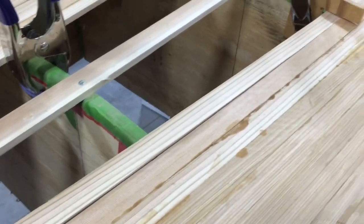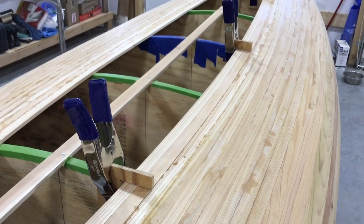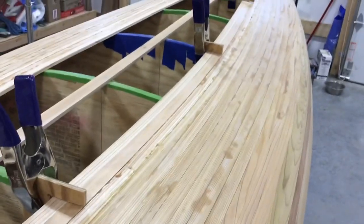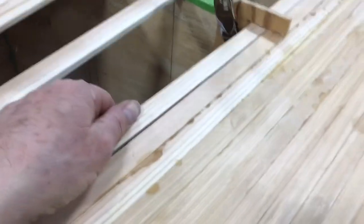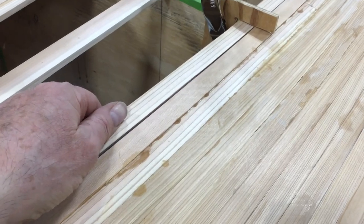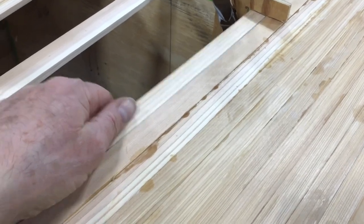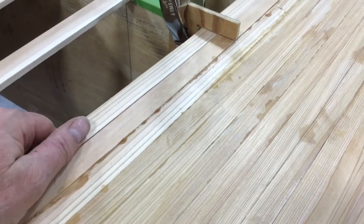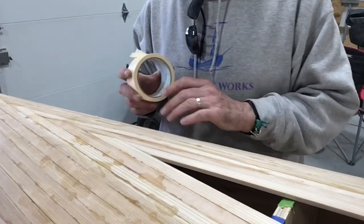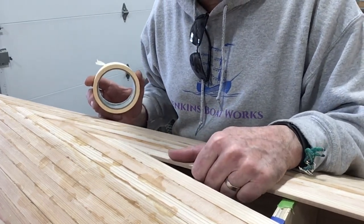It's dipped down a little bit right there — I'll pull that up when I glue it. The next thing we're going to look at is how do you get the glue in here when you're basically on a horizontal surface. I figured out a little trick: we're basically going to pull this strip apart just maybe an eighth of an inch, hold the glue bottle in there, and just run the glue right down in there, then push it back together to keep the glue on both sides of the wood and keep it from all falling through.